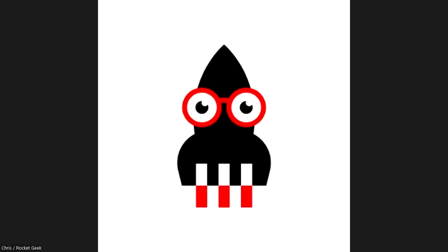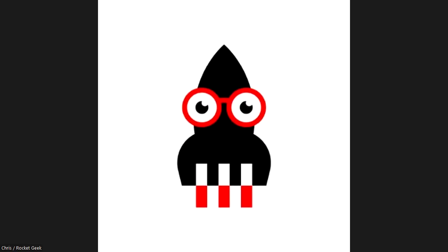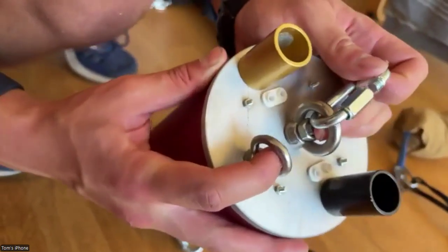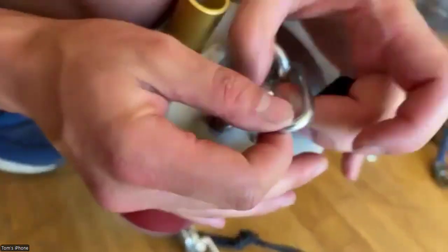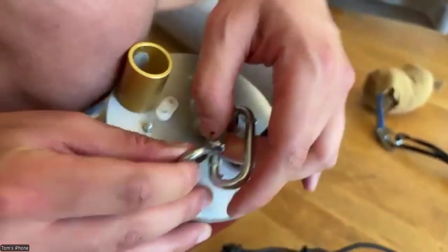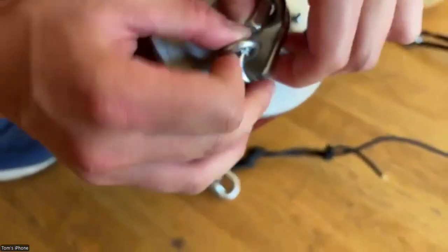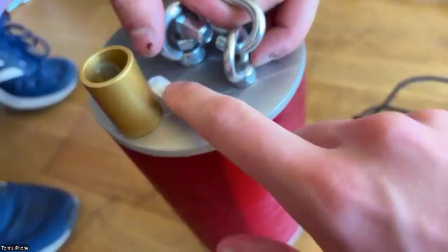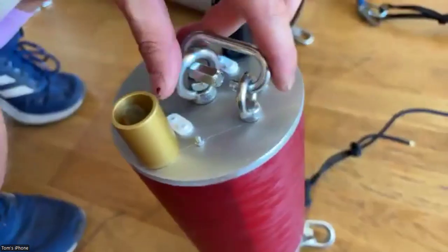So the eye bolt there, how are you going to keep it from rotating? What's the plan? So there's a secondary eye bolt, as you can see here, and they will be connected with a quick link. There'll be one on the other bulkhead as well. Last year we did a simple thing where we connected them like that, then wrapped it in electrical tape to stop any conduction. These little isolators just stop any shorting out. So if this is covered in electrical tape, it's not going to short the circuit that the E-matches need to deploy.